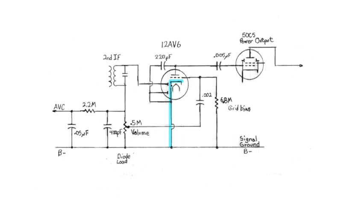So we have a cathode tied to signal ground, and that's very important. Right here, you'll see two diodes. They're picking up, or they're adjacent to the cathode. One here, and one here. Now one of them, the lower one, right here, is connected directly to the cathode, and which is tied to ground, which means, in this case, that this cathode cannot influence this plate of this diode because they're tied together.